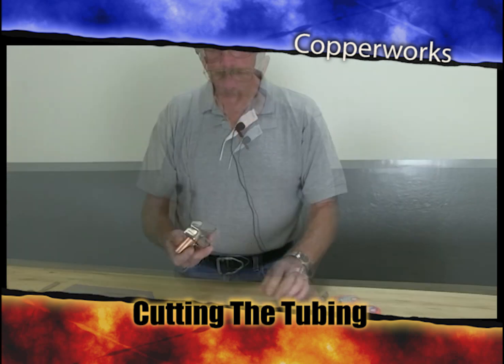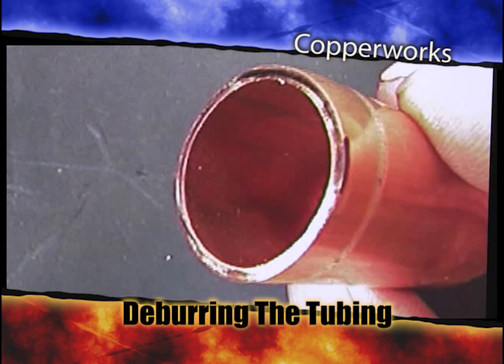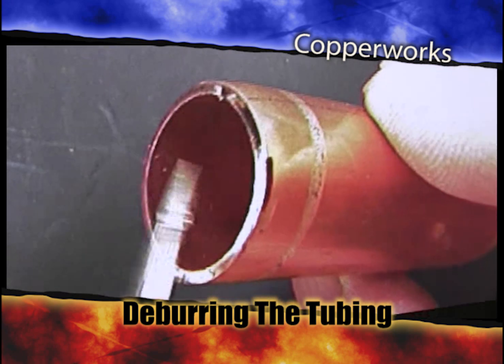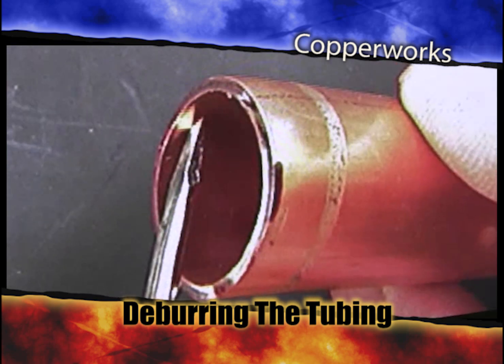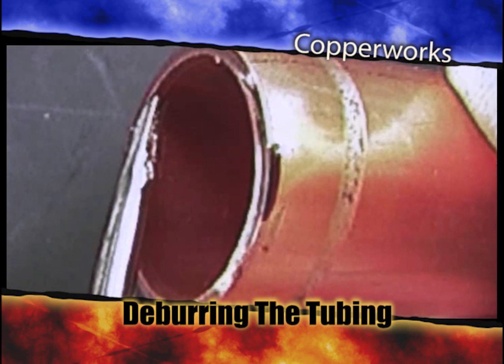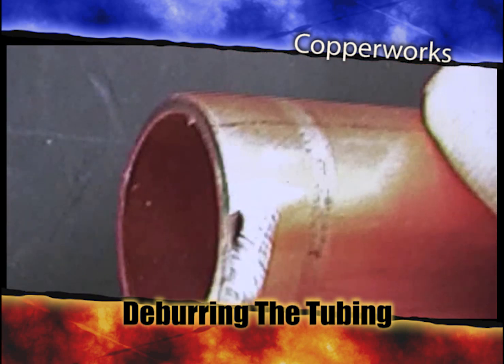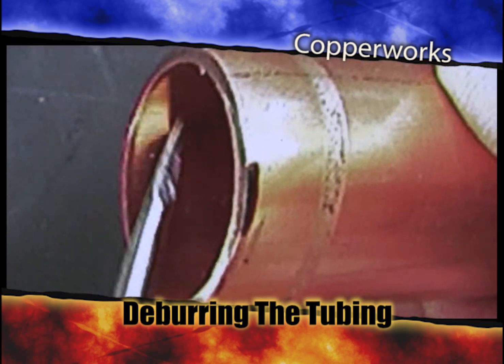I'm cut. Now, put this piece of copper tubing on the doc cam so we can zoom in and take a look at it. I'm not sure if you can see it well. What you have right here is a burr caused by the cutting wheel displacing the copper, and it'll leave a burr on the inside of the copper pipe. It also leaves a burr on the outside, which is not as noticeable. But here's what you do about that.